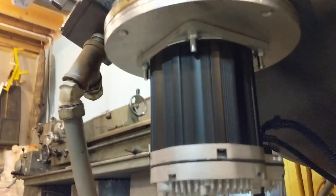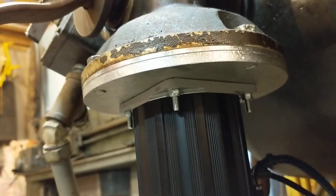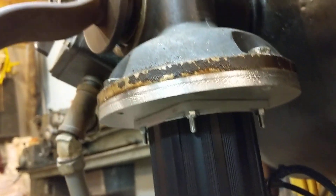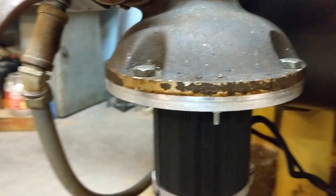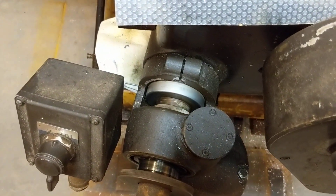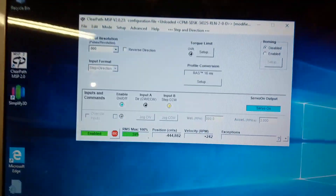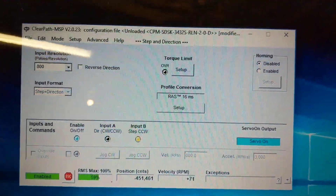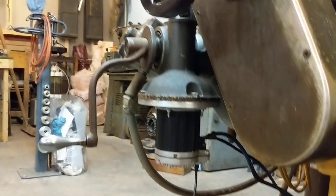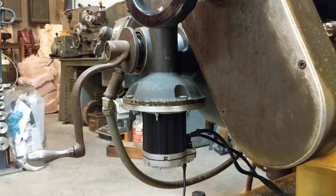What's cool is I machined a bracket to hold it, connected it up with that Loctite 638 glue, which is amazing by the way. Three hours cure time was all it needed to lock onto that spindle. I had a little bit of runout on my shaft, so I just matched up the high part on the shaft to the low part on the new coupler I made, and I have less than one thousandth runout now, so I'm able to direct couple it right in. It makes it nice and smooth, and I did buy a spider coupling but I don't even need to use it here. It's actually gorgeous.